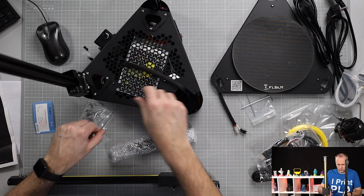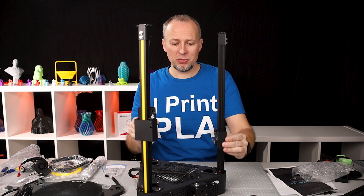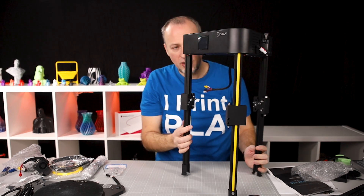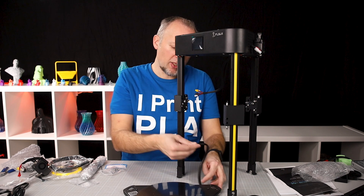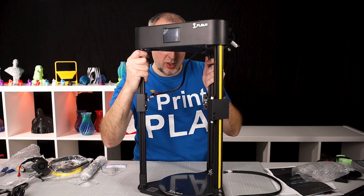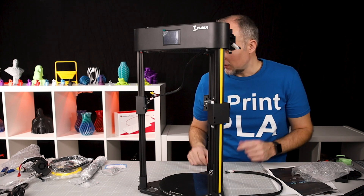The first thing I did was mount the vertical extrusions and connect the motor cables. So we mounted all three vertical extrusions with the motors which run the arms, and then the whole assembly gets turned upside down like this. It seems we need to align the display with the logo on the heated bed. The cable comes out at the bottom, so we put it down and align the logo with the display, then fix the three arms to the bottom plate with the heat bed.